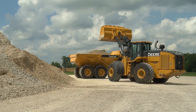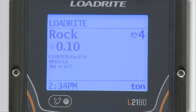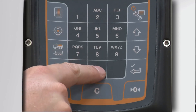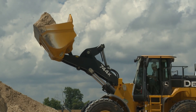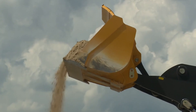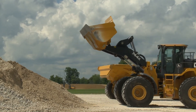Once a load is complete, the target must be reset. To reset the target, press the Clear key. The target reset message will display briefly and then the target screen will display. To enter a different target value, just hit the target key and select a new target value. Often, your last bucket of material to finish loading a truck will only be partially full. The first way to adjust is simply to shake some material out of the bucket, roll the bucket back, then lower the boom and raise it again to check the new weight. But if you need to repeat this step several times, it can be time consuming.